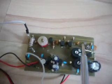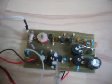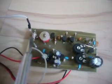The receiver has a MOSFET transistor — it's basically a straightforward receiver. Here is the MOSFET, here is a two-stage high-frequency amplifier, the demodulator, audio amplifier, and final amplifier for the loudspeaker. Depending on the coil you put in, you can listen to medium wave or shortwave.